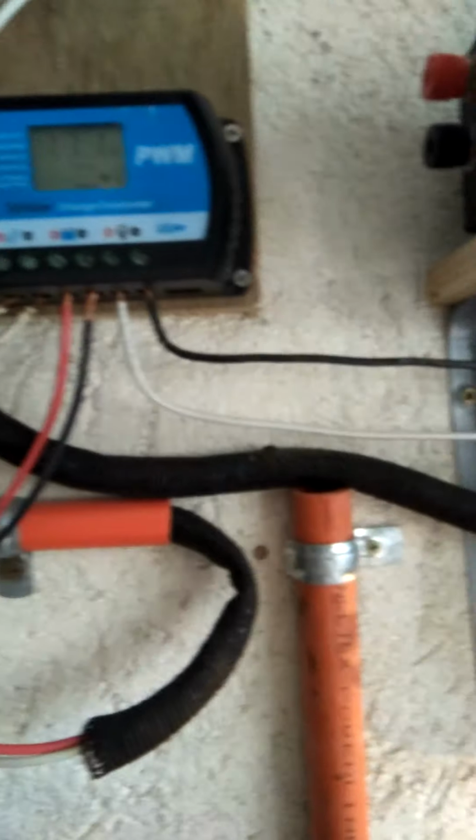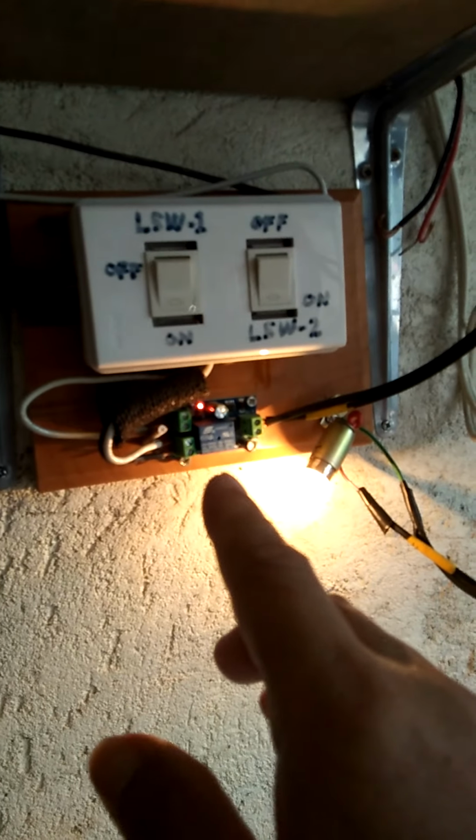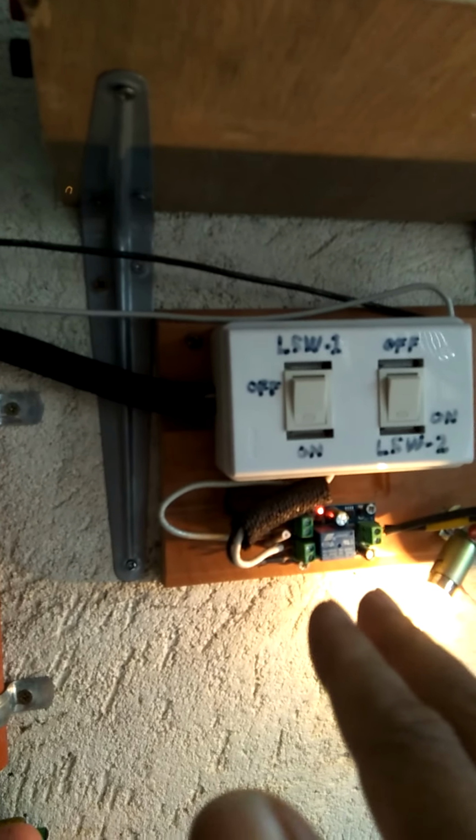The voltage is coming from the supercapacitor number 2, which is this one here. It's coming down, 11.1 volts. Let's wait and see. At 10.8 volts, it will switch over immediately, with no flicker, supposed to be no flicker. That proves the principle of operation, the concept of operation of the supercapacitor in tandem. There, switch over already.